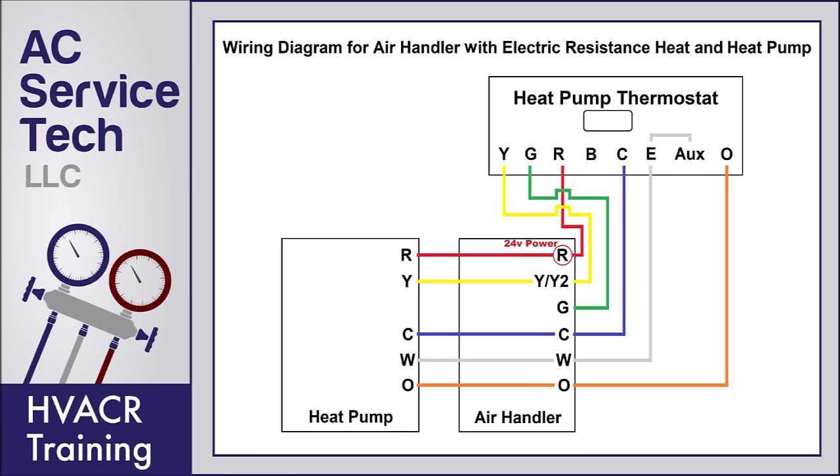Power is going to originate at the air handler control board and then move on from there. Power goes from the air handler board over to the heat pump thermostat, connects to the load of the thermostat to turn the digital display on, and finds its way back through the common wire to the air handler control board. You could hardwire the thermostat or not wire up the C terminal and just use batteries. The thermostat is basically just a switch — the R terminal is powered at all times and is ready to connect to any one of those terminals.